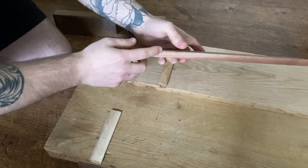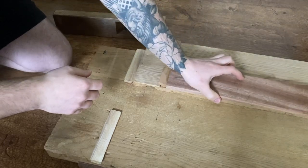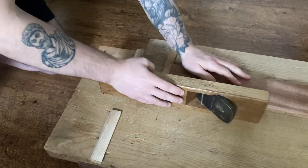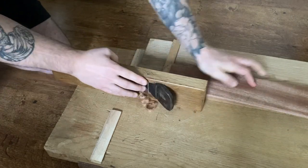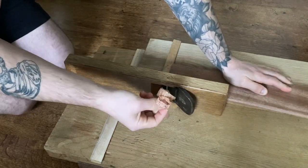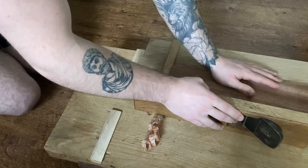make sure this is square, then what woodworkers would be doing is they would place this onto the board, slightly over this edge here, and you would take your Nagadai Kana and you can bring it all the way to the edge and push like this, or pull even, to get a nice clean shaving, just like this. So it's really efficient in this way. I absolutely love it. It'll make it flat, it'll make it square once you set it up correctly.